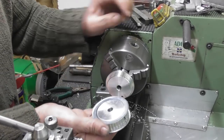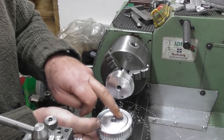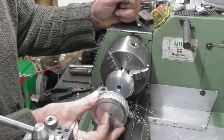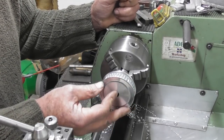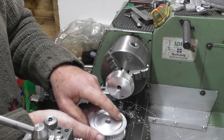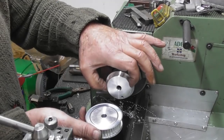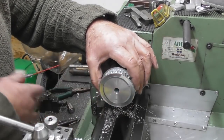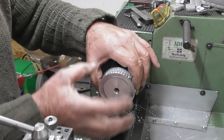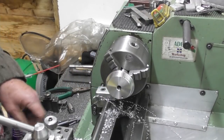So what I'm going to do is, it's really awkward to hold. I'll probably clamp this on the mill table and do I try and hold this by the OD and see how well that center runs? It's tricky, isn't it? But basically I'm going to put a counterbore in here, 8.9 deep by this diameter, whatever this diameter is, it doesn't matter a hoot. So that'll sit over there and be located, and then we'll have three holes through what's left to bolt this piece onto this piece. We'll have to remember that hole, that could come and bite us on the butt a bit later.